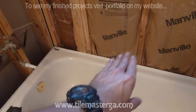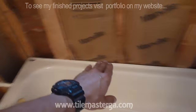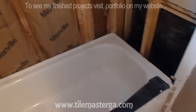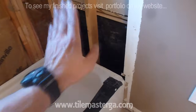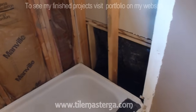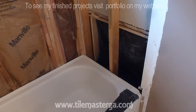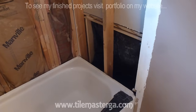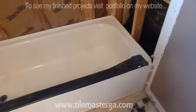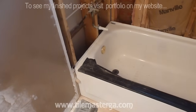The reason for that is we have to expose all the edges of the tub. We cannot remove the tub without having these sections exposed because the tub is going to be lifted, as you will see in a moment. Sometimes you can have Corian or cultured marble sitting on top of the walls — all of this has to be removed completely in order to easily remove the tub.